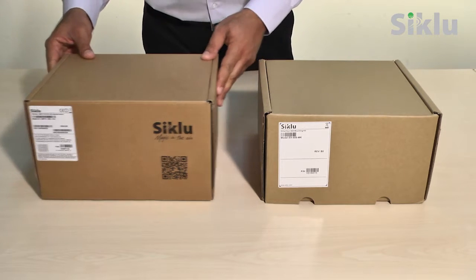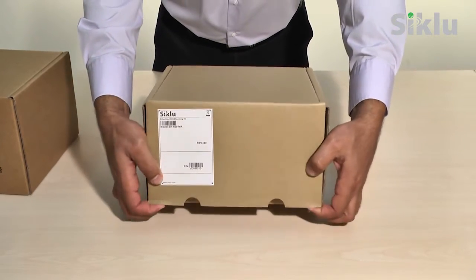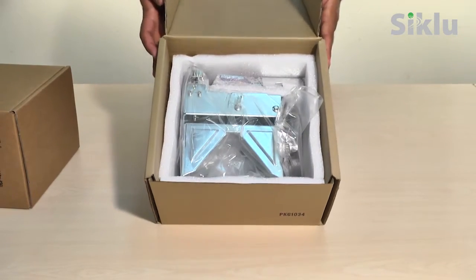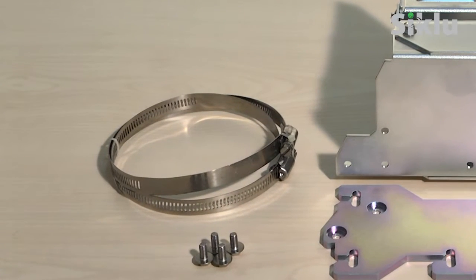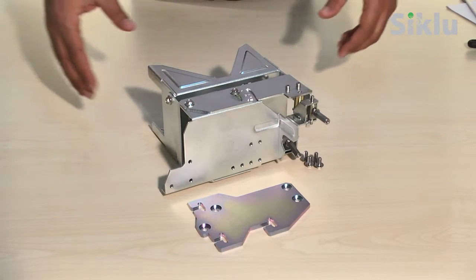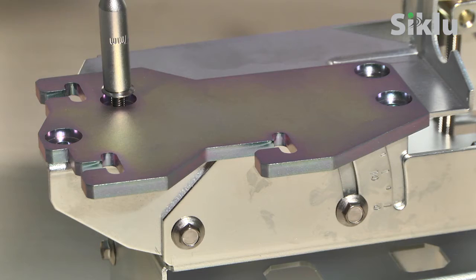The mounting bracket is packed in a separate box and already assembled for use. The bracket is suitable for any pole size between 1 inch up to 12 inches using the proper bands to hold it. We supply 2 scalable self-locking bands in the box, suitable up to a 12-inch maximum diameter. The first step is to attach the provided adapter plate to the bracket using the provided bolts.